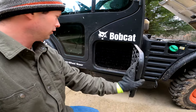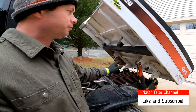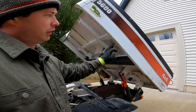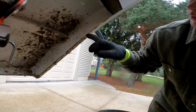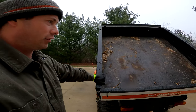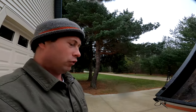On this side of the newer machine, this is just the AC condenser — easy to look at for any holes or leaks. Prop up the bed and look underneath — you can see this one has some scratches with some rust building, which is on my list to treat. You'll see road spray and debris on the back side, which is where the rust is worst. Check along the bottom edge of the tailgate as well — that's another common rust spot. This one had a bed liner sprayed in it; most of them are just painted white inside.